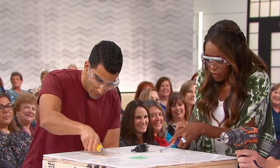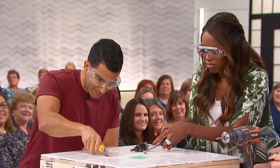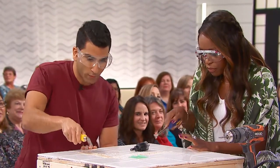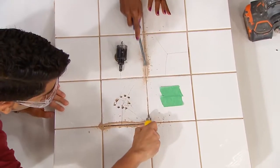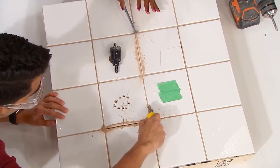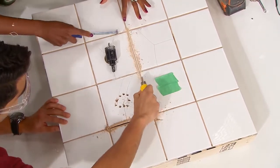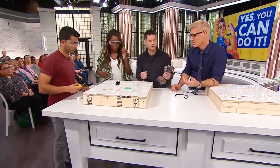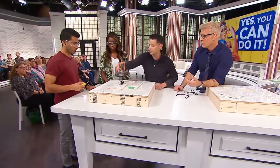So I just do like this? Yeah, you got it. That's easy. And if you don't use these tools a lot, you can probably rent them as well. Yeah, you can from your home hardware store or anything like that. Now, once we've got the grout removed, we want to move on to the next step, which is basically creating a hole to be able to pop out the tile. So I can take my drill and drill a series of holes here, and then pop out that center section.